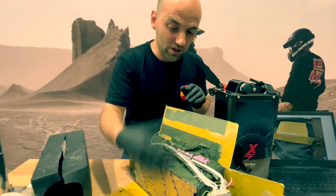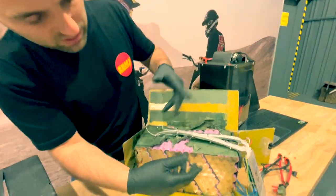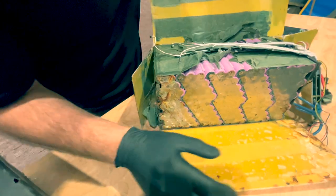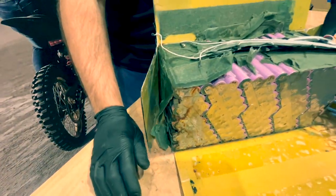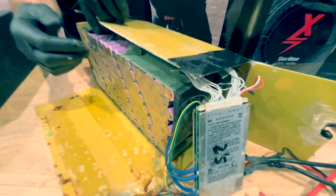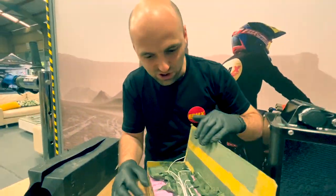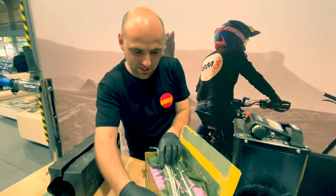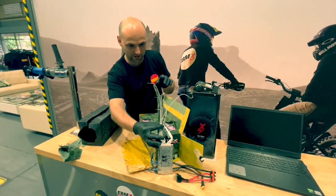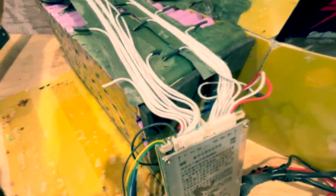The reason I opened this pack was actually to investigate and see exactly what happened — because it's interesting. Lots of cell tabs came undone. As soon as I pulled this thing, it was just the lightest touch and this whole series here came undone like that. The whole lot, just like that. Broken tabs — because of corrosion.